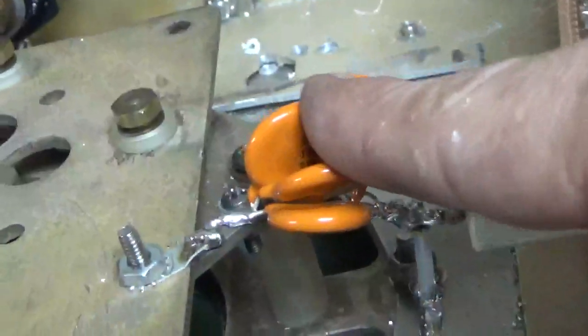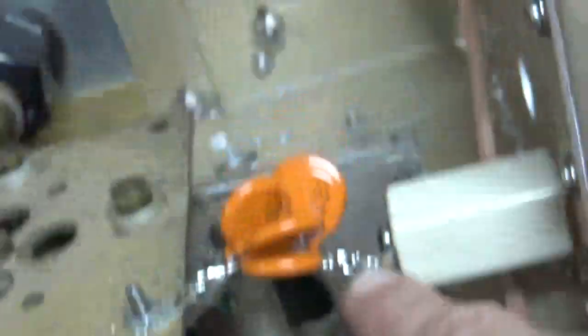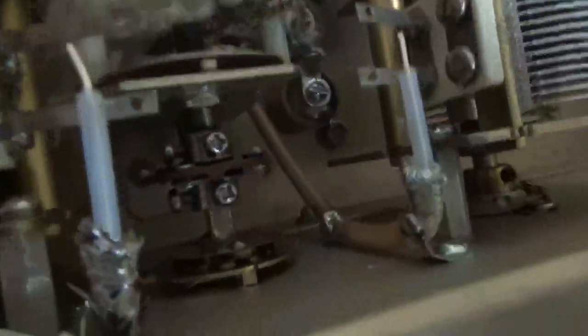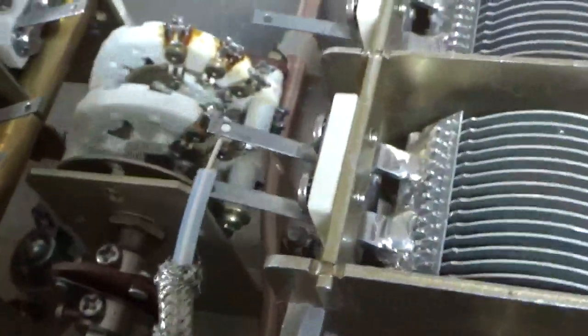I have 3x .01s in parallel with another three over here on the other side. The junction's connected to the center of the coax — one side for one side of the filament, other side for the other. I used kep nuts with the screws to secure them nice and tight. I brought the input coax right here. There's a solder tab down there and another solder tab here — it's all soldered. Short unshielded lead length — the strap will come and then go around.